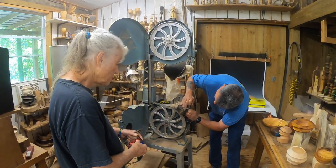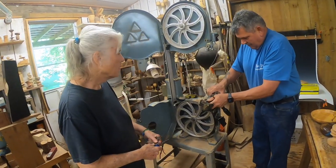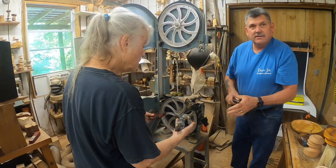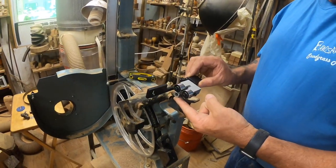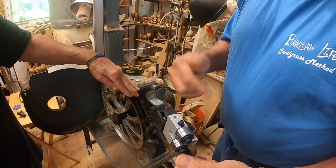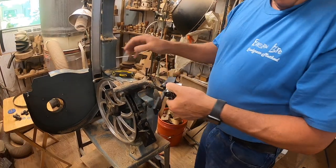This is what froze on us. Once you get those two screws out of the side, the lower unit is completely gone. This is the new Carter unit here, which is your new lower guides. It comes with a bolt that is already attached inside, because otherwise you'd have to take that off to put that bolt in. And then depending on what version you have will depend on what extra bolt you'll need — Carter also provides that.